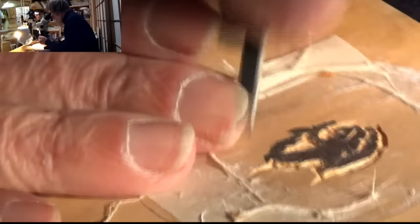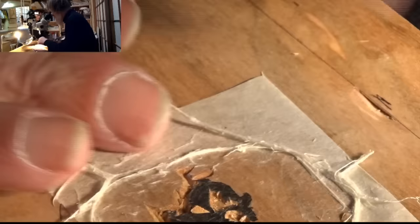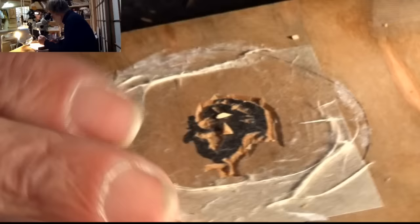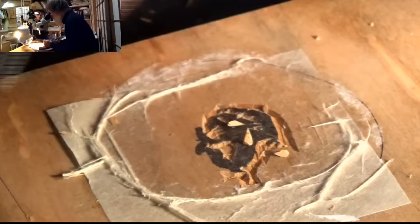So I'm using way more strength than is necessary. But because I'm also backing off and countering that strength, there's some sort of huge reservoir of power that doesn't get used, but it allows your knife to slice through the hard parts without jumping ahead through the soft parts. It's really difficult to verbalize. But it's not free. It's supported and allows. So my right hand is guiding how fast this thing moves. Well, I mean this finger. This finger is the guide that is letting the knife go forward. If I pulled it away suddenly, the knife is going to zoom, drag through this thing too fast.